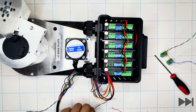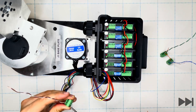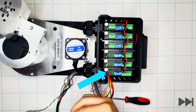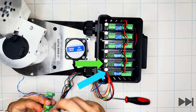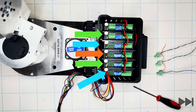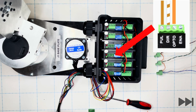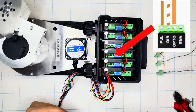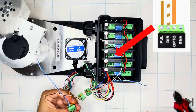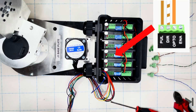We go through each terminal block installing the blue, then green, then brown wire pairs and repeating that pattern. From the bottom it goes blue then green on the second motor driver, brown on the third motor driver, then back to blue, green and brown. The solid wire is on the left-most terminal, the striped wire is in the middle, and the solid orange jumper cable is in the opto terminal — the third from the left.